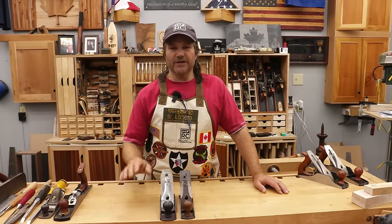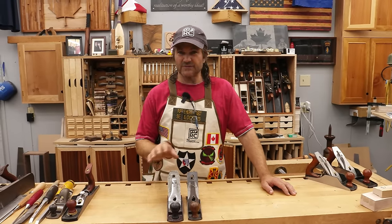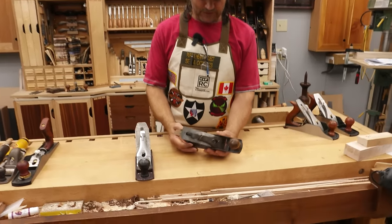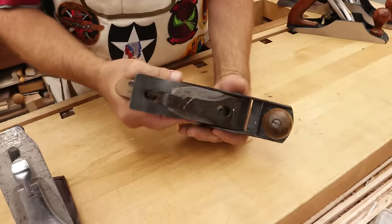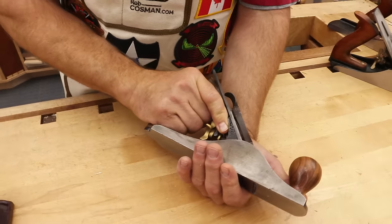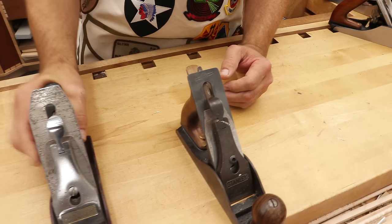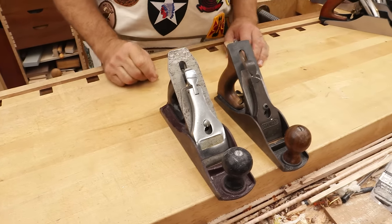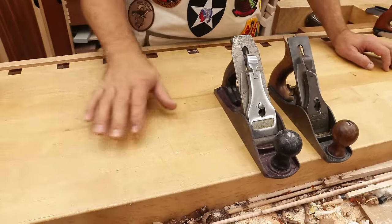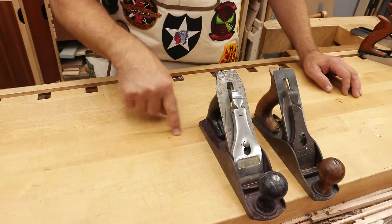If you're going to woodwork, everybody wants a hand plane. And as you migrate toward hand tools, of course, you're going to need a hand plane. There's lots of advice out there, but I find that most of it is pushing people towards fours, fives, even threes. I'm going to suggest why you might want to not consider those. This is actually my first ever plane — it came from my grandfather. It's a number three, but if you wear a large glove, you're going to have a very difficult time cramping your hand down inside there. It's designed to be a three-finger grip, and that's just uncomfortable. And the four is not much better.